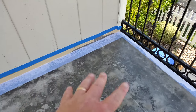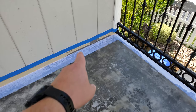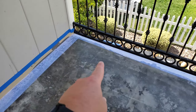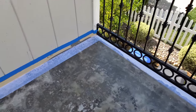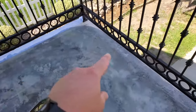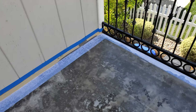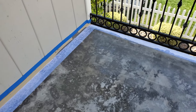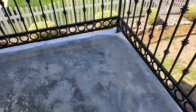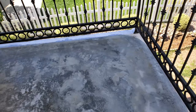Let me explain the technique. I'll use the brush going real heavy all the way up to the painter's tape, then etch in a little bit where the roller can't go. I'll do that around the whole edge. On the other side is where the painter's tape is — you need to remove the painter's tape before it completely dries. Once the brush coat is done, I'll remove all the painter's tape, then lay down the first real heavy coat with the roller. The product needs three to four heavy coats, so I'll do one now and one before end of day.